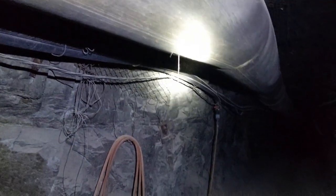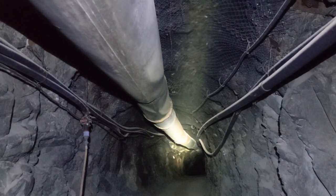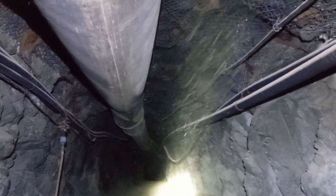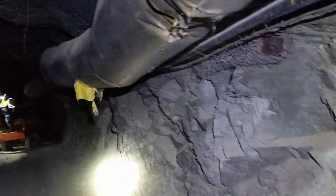And I've got most of the hangers cleaned up, cut that one. Because these hangers, if they snag on a ROPS, then it can start trying to unravel the whole bag. And once it starts to unravel, that's where you'll get a hole. Right up there where my lamp is, it transitions over to galvanized steel rigid bag, which is both suction and pressure rated.